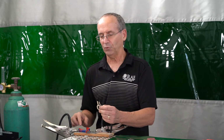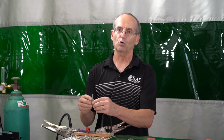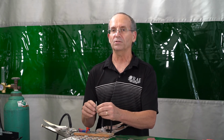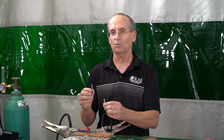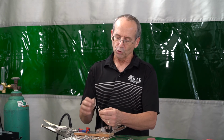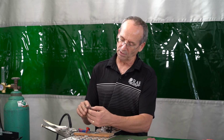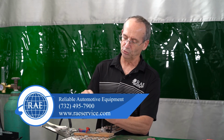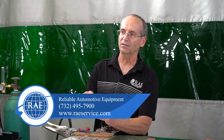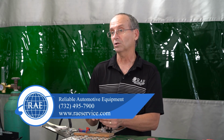Be careful if you're welding some of them in a row and you have some tall ones and some short ones. It is not going to pull the dent out correctly. If you are going a couple of them in a row, make sure that they're all the same length. You can also take these as they get smaller, and you can actually line up the bottom piece, put them into a vise, and you can actually run your roll lock over the end of it to make them all the same length again so that you have a good pull when you're doing them into a crease.